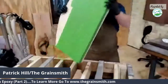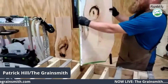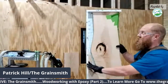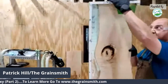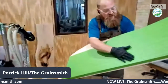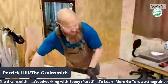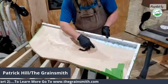So this side rail, I just took a piece of hard maple that I had scrap, cut it into 2-inch strips, and encapsulated it in Tyvek tape, and then I did the same with this section, taped them together, taped them onto this piece, so there is nothing in here. It's only wood and tape. Right here, I've got the sticky side up, so the tape is actually sticking to the bottom of the wood.